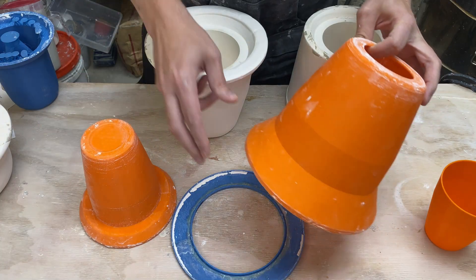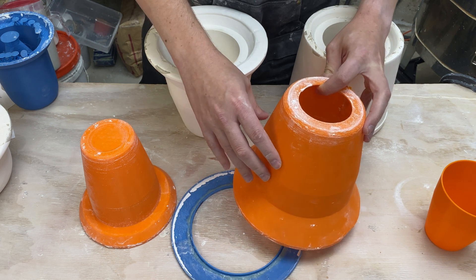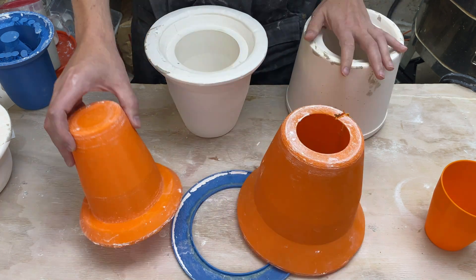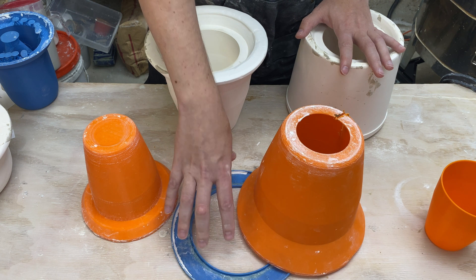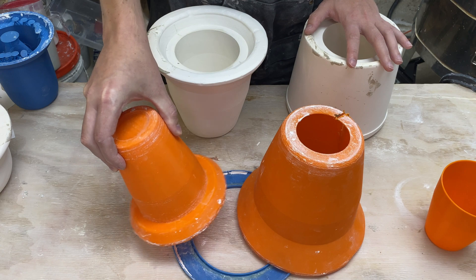So where do we go from here? One feature I definitely want is to split this outer mold so I don't have to cut it off and I get around the build volume problem. I'm going to have to address this long vertical seam in the molds — both in the software and how to attach it. Pretty much all of the options for the inner mold require a better attachment process as well. This issue of attaching, detaching, and creating a reliable system with the right materials for a good joint is going to be on the critical path no matter what.